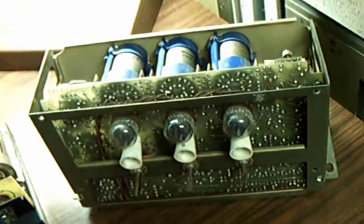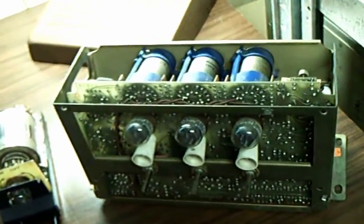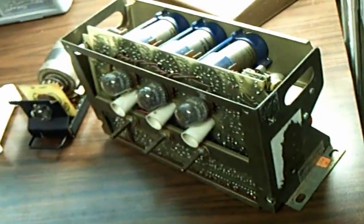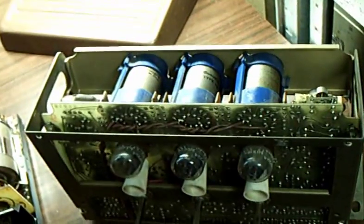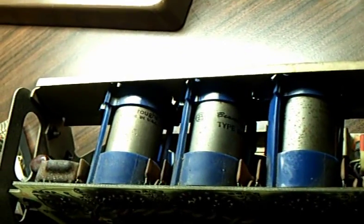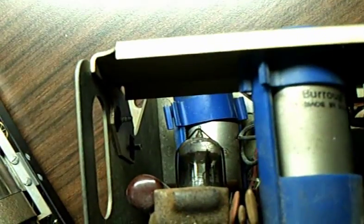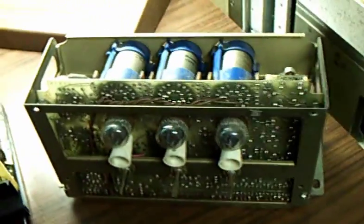This is a 101P479 Burroughs programmer. We have no idea what system it's for. We think it was made about 1965 and possibly derated somewhere around 1971, given the date code and the date stamped on the side of the unit. This is the most complicated intact beam switching tube circuit we've ever seen — it has four BX2004s and one BX2005, and we don't have the specifications on either of those. You'll see one transistor literally stuck up on a pedestal — it is 1965 after all. It's got a few other tubes down in there, another BX2004, and the red capped one is the BX2005. Unfortunately it looks like this was left in somebody's shed for several years and it's got some rust on it. Magnetic beam switching tubes — thanks for watching.